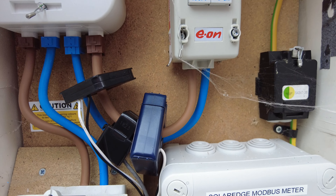The CT wires are all just clamped in there — give them a little tug to make sure they don't fall out, then close up the box. The green light is flashing, though it's not showing up very well on camera. It's flashing blue now, then red — it's in pairing mode. One thing to know when installing it back into the back box: there's a large resistor on the side near the CT clamps, so I recommend putting it in bottom-end first so it fits flush — you don't want to catch and damage that resistor as these are relatively expensive but very handy.